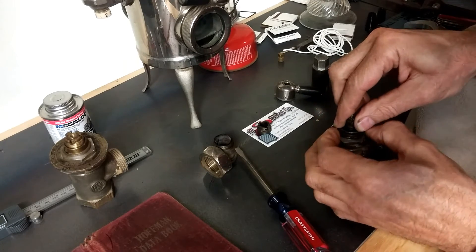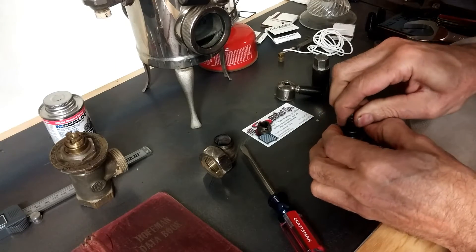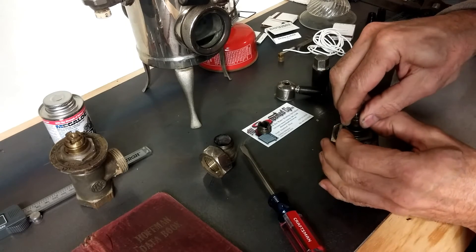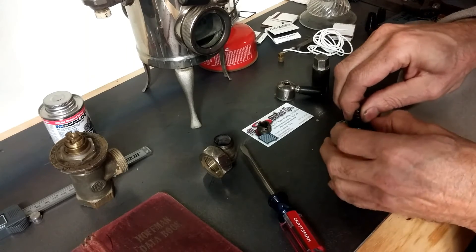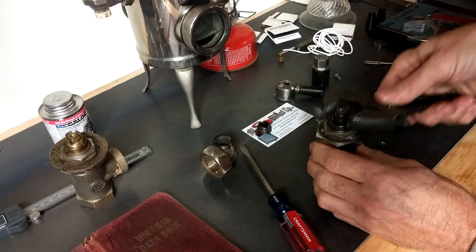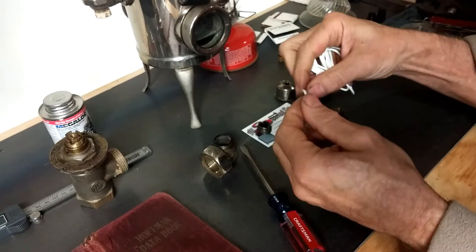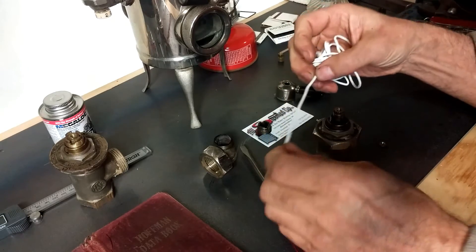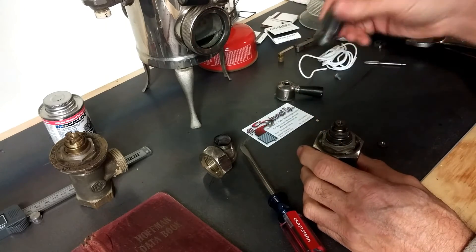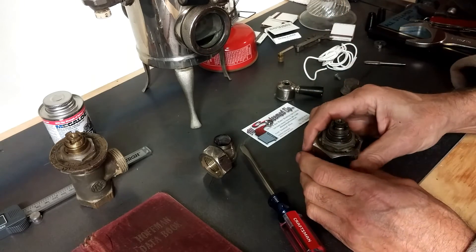This is how you're supposed to be able to adjust it: dial it in, then lock it using your adjustable wrench — lock this top nut down and make sure that doesn't move. Then you take your 3/32-inch packing material; I'd use about nine inches at first, pack it in, pack some more in, and put it back together.